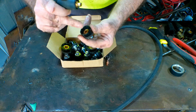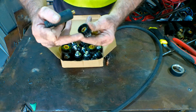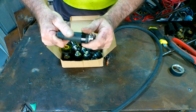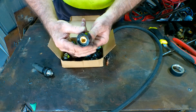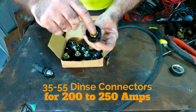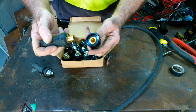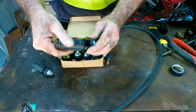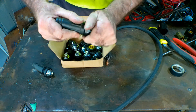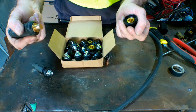You can also buy the machine ends. My welder at the moment doesn't earth properly because it's burnt out in the socket, so I'm going to have to replace the actual socket in the machine — I might do another video on that. Anyway, piece of cake. Then you go up to the next size, the 3550 plug, which is bigger. You can see the cam in here — it goes around on the inside. Put it in there, lock it up — Bob's your wombat. You can even join wires and make extension cords with these.